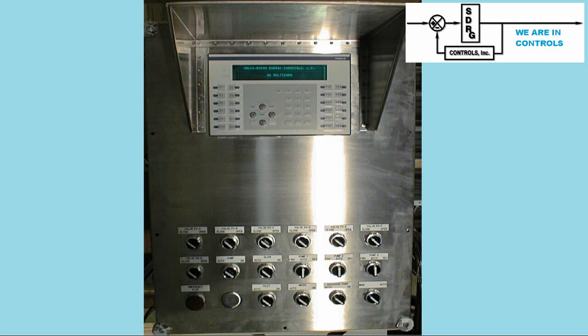Over the years, the system was improved and modified. Key improvements included the transition to PLC controls and changing the user interface from a computer with a screen to a PLC with an HMI. The new controls hardware proved to be more rugged and durable. The overall system provided cost and supply benefits by giving the customer materials needed for the job at that moment. The customer found that the same mixing skid could be used for several different product lines — the skids were easy to clean, durable, and could produce many different product variations. Experience taught them that oil-based products could be produced on one system, but water-based products should be produced on a separate group of mixer systems, as thorough cleaning was required before changing product-based material.